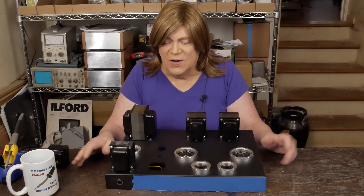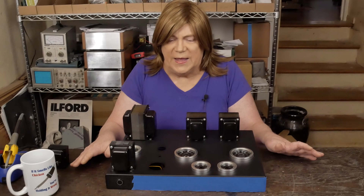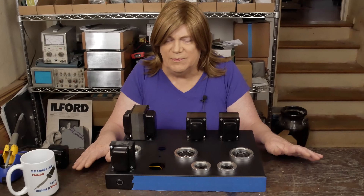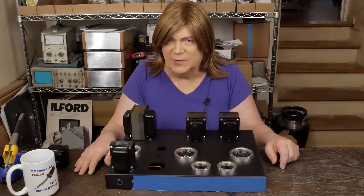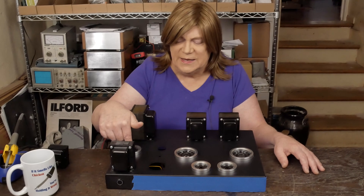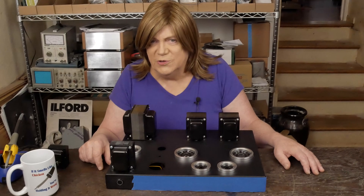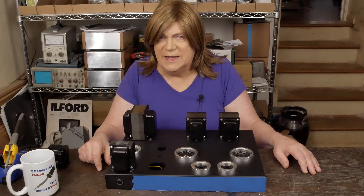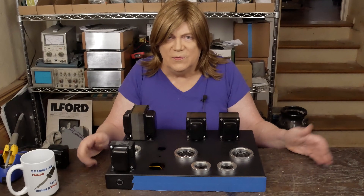On the power supply I'm not even sure exactly how I'm going to do it. I started thinking that 10 ohm resistor probably needs to go back to 50 ohm. I may end up putting a solid state rectifier in to get to where we need to be, which might work better for a budget build anyway. If we do put in a solid state replacement for the rectifier tube, you might as well just put the diodes inside the amplifier and get rid of the tube socket.